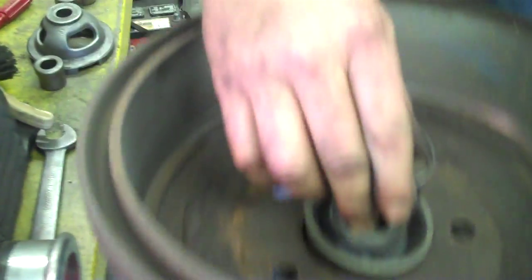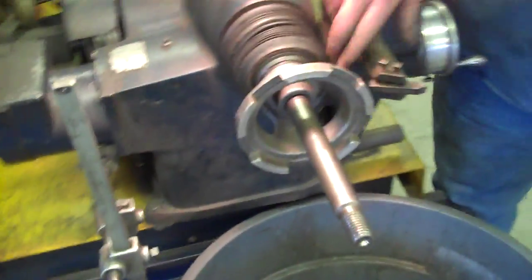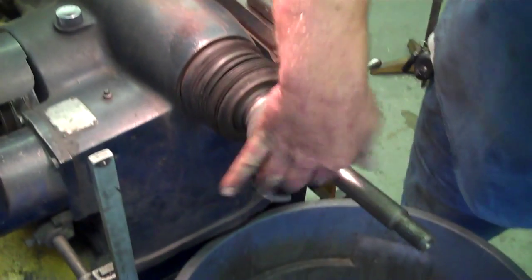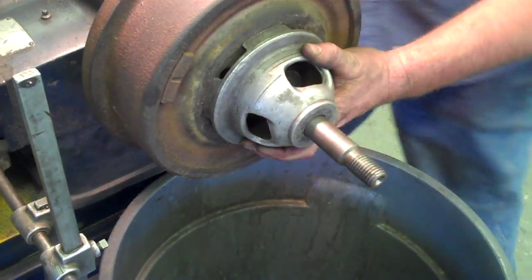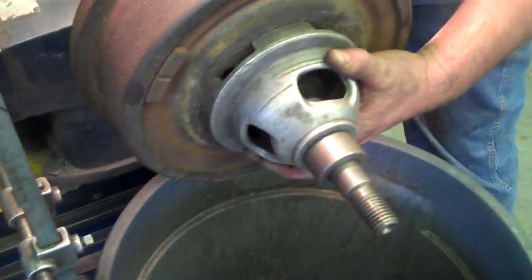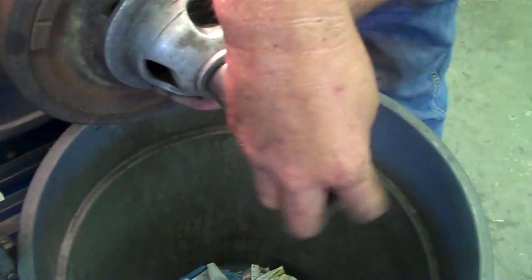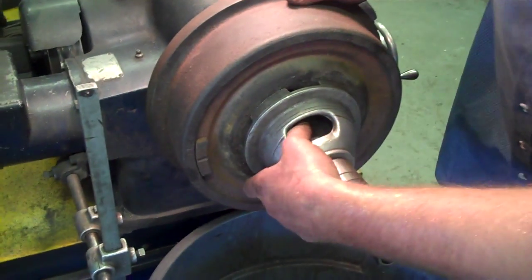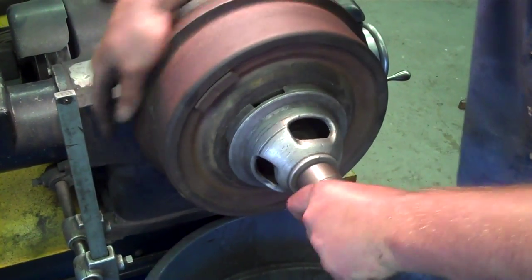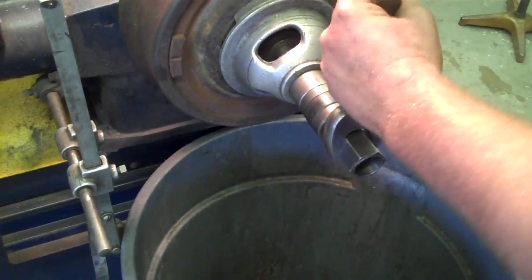What happens with a drum is it gets pinched between two cones. Two cones is what pinches it, and it's centered by a little dowel or another cone with a spring. So I'm going to go a cone, move my bit out of the way, then I'm going to go spring, my dowel, and I'm ready to put my drum on. Put that on, smash it in between here, take a spacer, put my vibration damper down there, and then put my nut on. You've got to go counter-clockwise to tighten this. Before I tighten this, I'm going to hold that centering dowel inside and just kind of spin it. Then give it a little snug, grab your wrench, and pop it. We have the drum mounted, we have our bit mounted, and now we're ready for our belt.